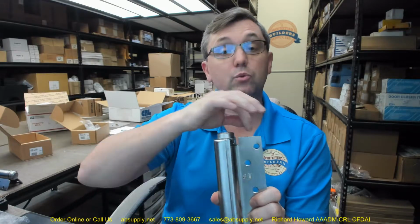They put that roll pin in there so that you can get the door hung and still have enough room on either side to attach the fasteners. Do not remove the tension pin. Don't take anything out of anything at this time. The leaves are held apart less than 90 degrees, which gives room enough to fasten the hinges into position.